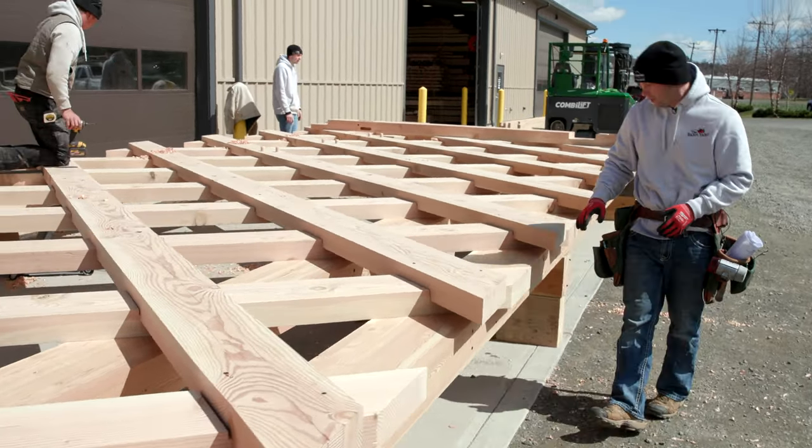This town truss design was patented in 1820 by Ithiel Town, an architect out of New Haven, Connecticut. And they're really popular because of the simplicity of these trusses. They could be built at most any length just by adding more lattice members and making the truss longer.